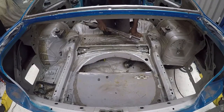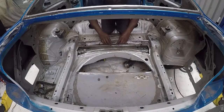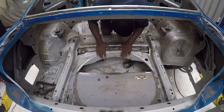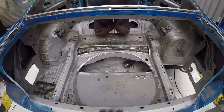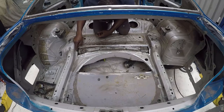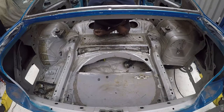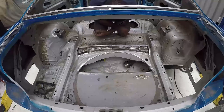Very simple. Just some box section steel — I think it's 20mm — and some 3mm plate. I've got some sections to put in here just to make up, and I'm going to weld them all around here, and that'll be that. I've also got some weld nuts that I'll weld to this plate so that'll be nice and firm.